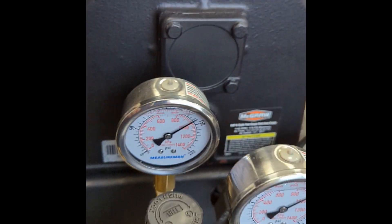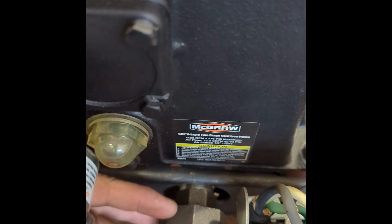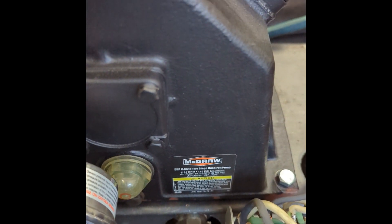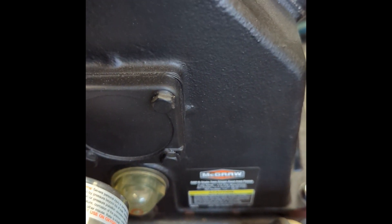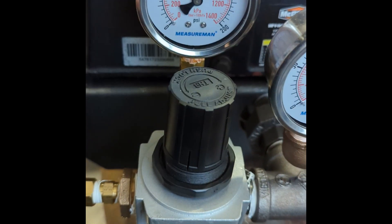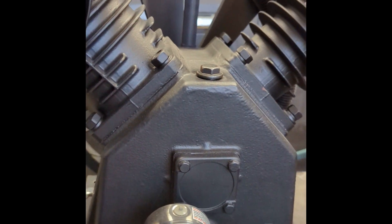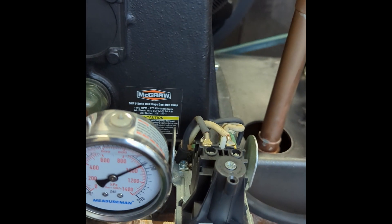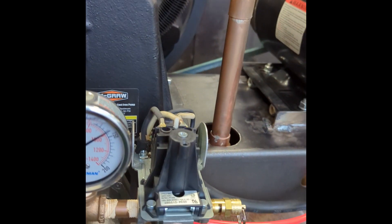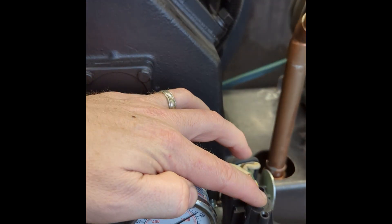For the outlet setup I used pipe for everything. I used a union coupling so I can easily remove the gauges and switch for maintenance. It goes from one-inch thread converted to three-quarter, then into a T. I have an adjustable pressure valve that handles up to 175 PSI — which is also what the compressor pump is rated for — and a pressure switch. The switch is rated for 175 PSI but kicks out at 140 PSI maximum.